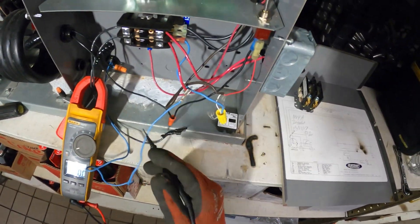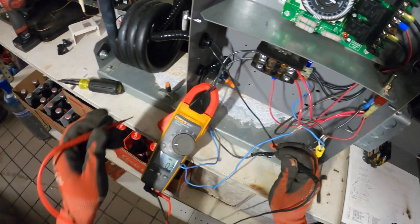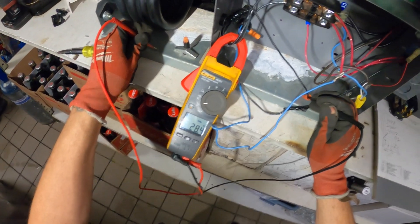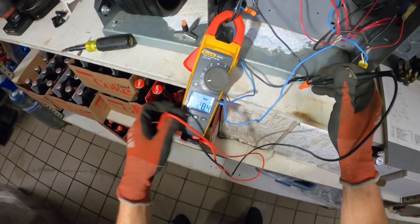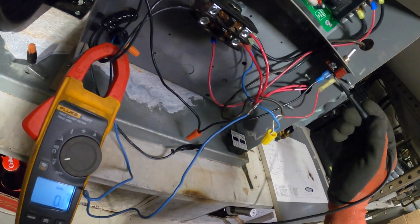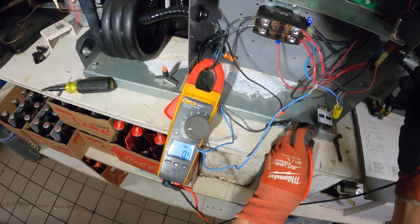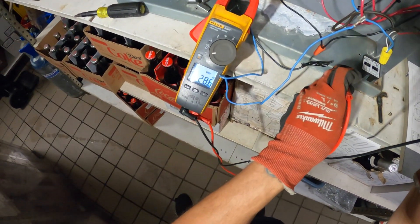I unplugged that one side. How come we've got 20-something volts? That's so weird. We only got 28 volts — 28 volts coming out of this switch. What about coming in? Also 28. Wait, now we got 120. We've got the 208 coming in, then this blue leg goes into here into the white — 120 — and then it comes out at 28. Hold on.